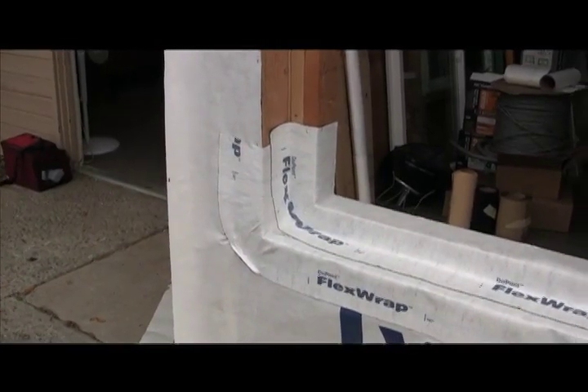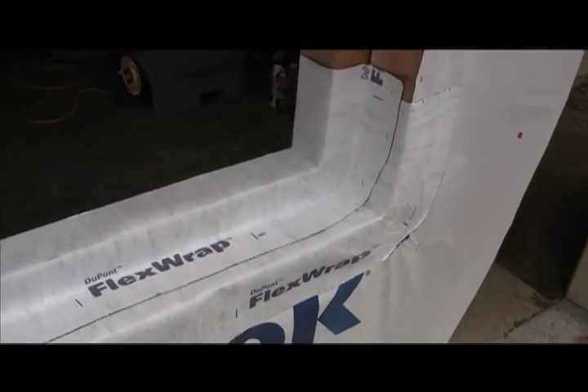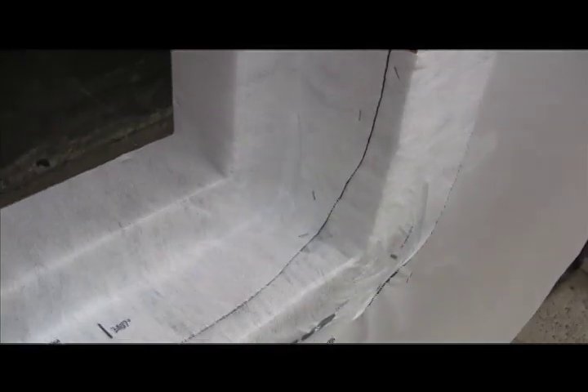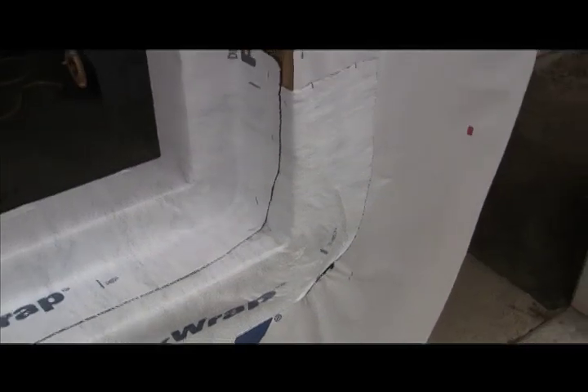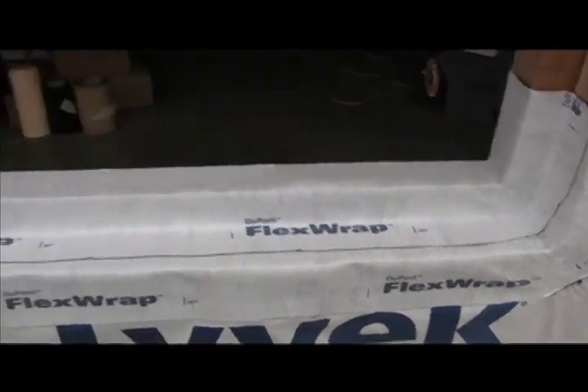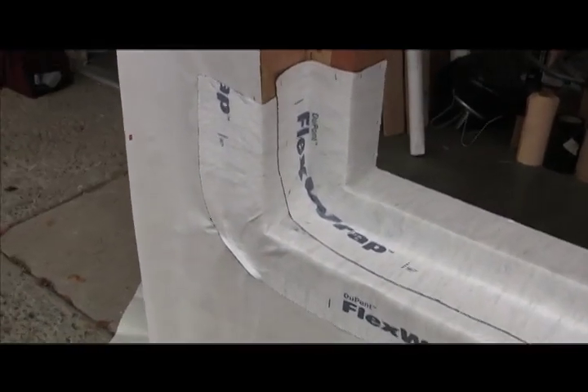There's FlexWrap flexed on top of the framing sill. You can see the inside corners are rough — that's why we have our FlexB piece in place. The outside corners always look nice; the inside corners are what you have a hard time with, and our B piece ensures that that is safely flashed. This method demonstrated FlexWrap on the framing sill. Next is an alternative with straight flash to achieve tighter inside corners.